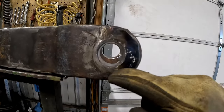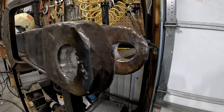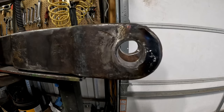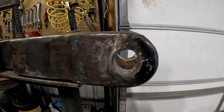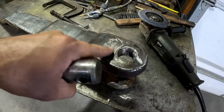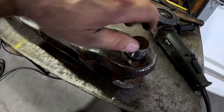This side's built up — I'm comfortable with that. I'm going to work on this bottom one; it's egged out pretty good. This took a lot of work — a lot of building up and filing. Dad and I switching off filing. If we ever need to escape from prison I think we can get out with a file. I feel very good about this drawbar; it's in very good shape. There's a little bend in here but I got everything built back up right where it needs to be. Get a coat of paint on it and you won't even notice it.